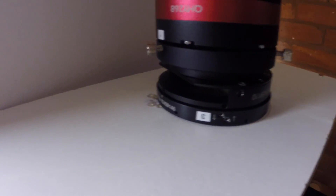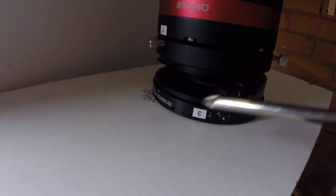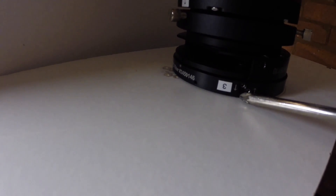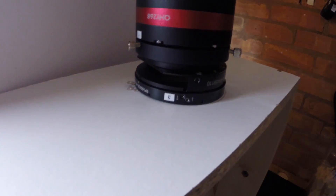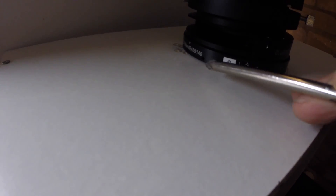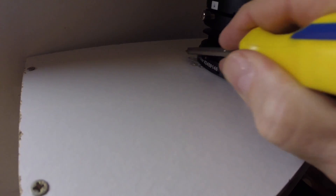To adjust it, you need to get the bottom dot to the far right-hand side of the traced circle, then with your tilt adjuster adjust the screw on the opposite side — the left-hand side. It may not be exactly opposite; it could be roughly opposite. The idea is to adjust that screw to bring the reflected dot back to the middle of the circle, which removes the tilt. When you do this, the dot may not go exactly back to center — it may move to a center line but be slightly above or below; this is fine.